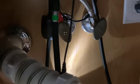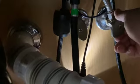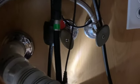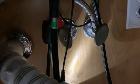So I had this black pipe. This was already connected there. So I have already started doing some work. First thing I did is turned off both these valves. They are completely shut off. Opened the tap so that if there is any residual water, that goes away.